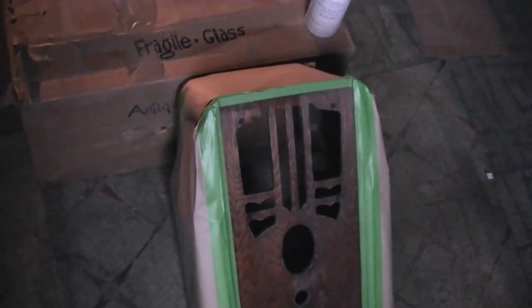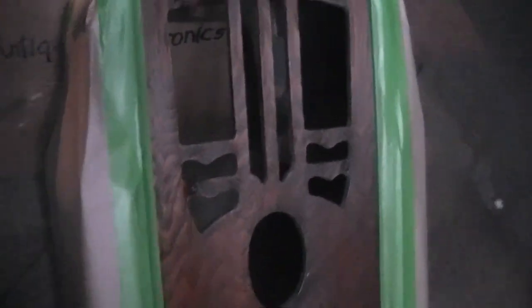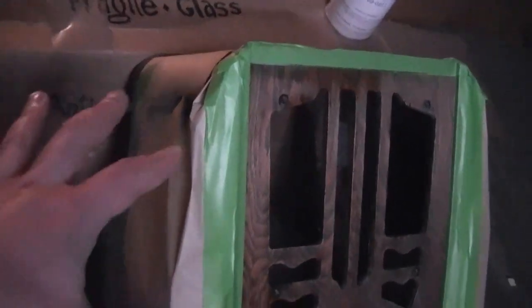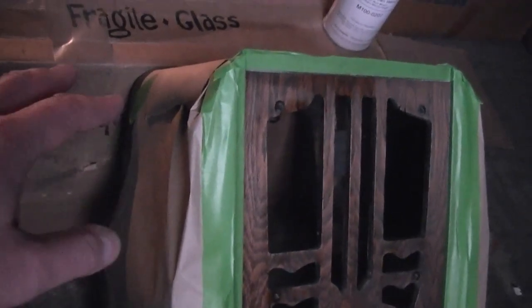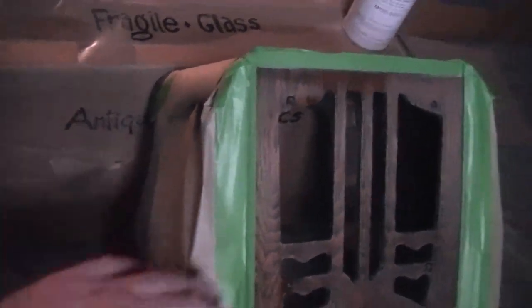Here's a little test I just did by spraying various toners on some heavy white paper stock. The top is Extra Dark Walnut, then Medium Brown Walnut, then Universal Walnut. The two outer ones are more like what real natural walnut looks like, but I want more of a brown color, so I'm definitely going to go with the Medium Brown Walnut. I've got the set all ready for spraying the medium brown toner on the center panel. I masked off the sides to minimize the buildup of lacquer so it's not too thick.